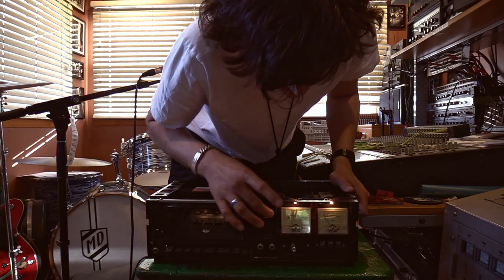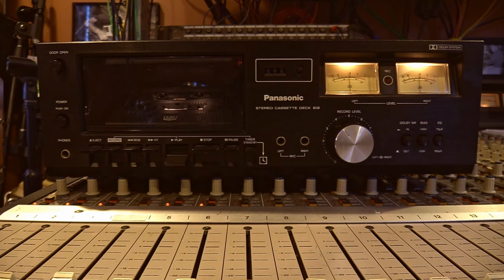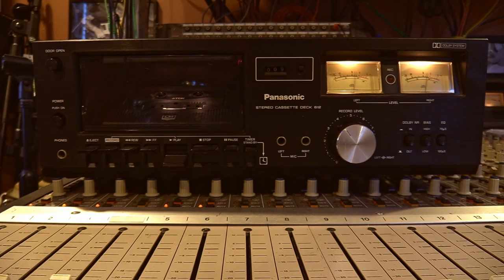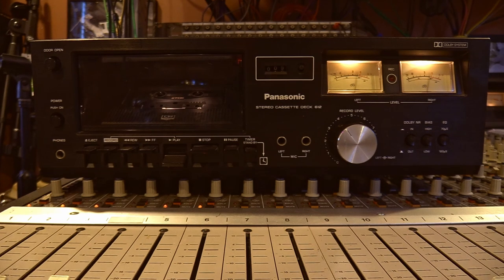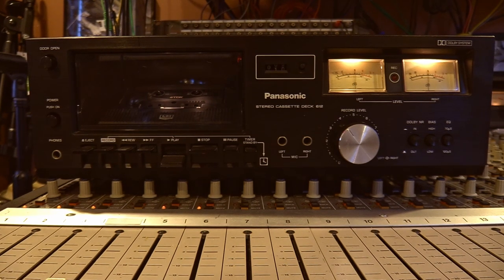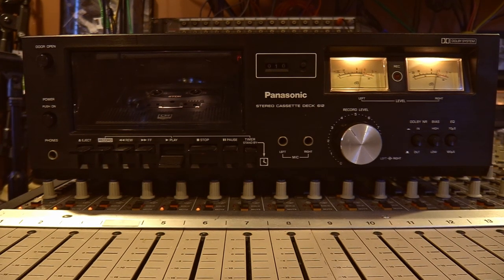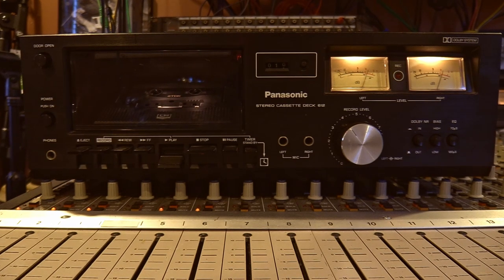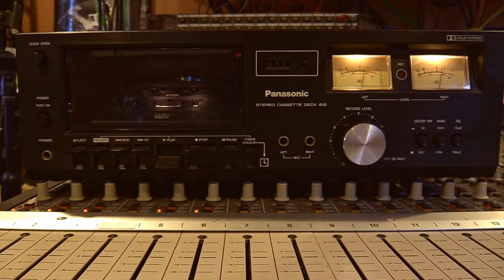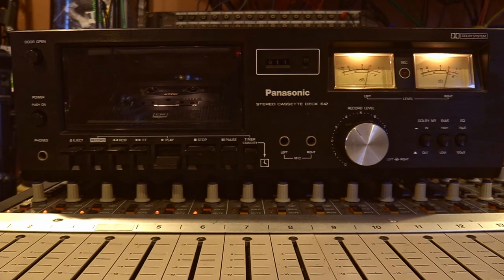I did some test recordings with some of my own material and compared the pre-cassette version to the post-cassette version, and honestly I'm pretty impressed with this machine — I was expecting way worse. For my purposes it's going to do me just fine. The calibration process I did today is really rudimentary, but the point is I got something usable with just some basic calibration steps. You don't need any fancy equipment — all you really need is a tone generator of some sort, and you could use a cell phone for that purpose. I'm going to end this video with an A/B comparison of a mixdown pre and post going through the cassette deck.